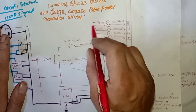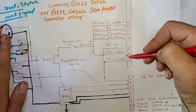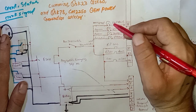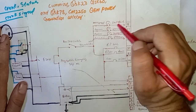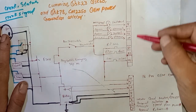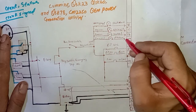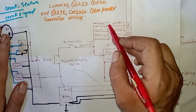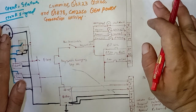These are all connected through the key switch from the emergency push button NC contact, feeding positive to all lamps. When a fault occurs, this side provides grounding to the light and the light glows. If there is no problem, ground is not available and the light does not glow. When a pin is grounded, the light bulb glows and you can identify what problem exists.